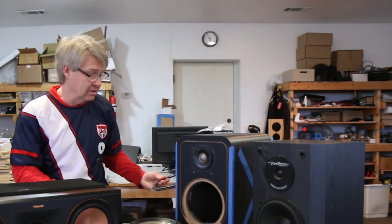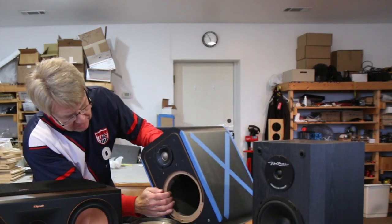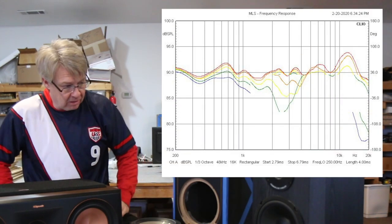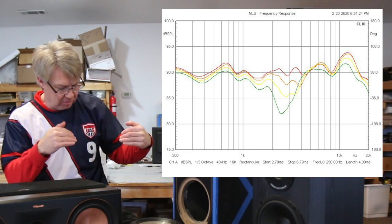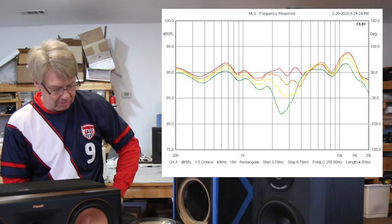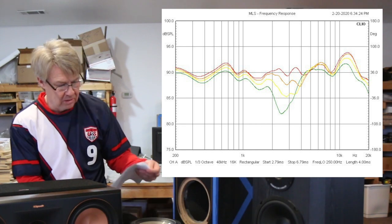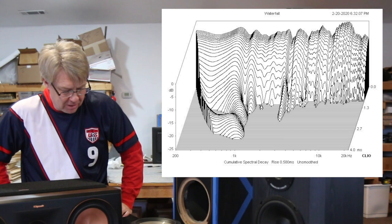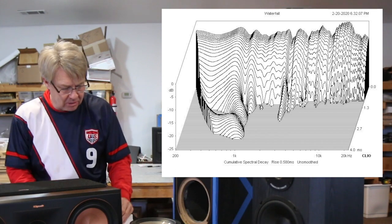The grill worked pretty well — a few little ripples here and there, but overall made nicely, held on magnetically, with very little effect on response. There's a little plastic cover that flush-mounts the tweeter; it looks really nice, good aesthetics. The cabinet looks nice and has a layer of foam on the inside. Off-axis horizontally looked pretty smooth; vertically the off-axis looked pretty good as well — a little dip at the crossover point as you moved higher, but not real bad. Overall they did a pretty good job with the crossover design. The spectral decay shows a little stored energy around 700Hz, but it's not bad, and a little trace near the crossover point — overall pretty good.